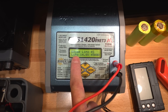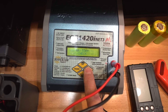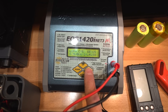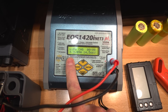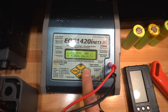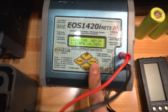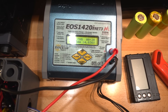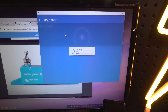Going back to the charger — it's on my old quad bike settings. Charge rate: 4 amps. We'll select battery check — connected cells: four cells. You can see how good this charger is, very foolproof and very safe. It's going to watch each cell as it's charging. We might be able to crank this up — it's going up to seven amps now. Before I do any more I want to go back to the meter and make sure it's sort of reset or recalibrated.